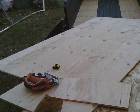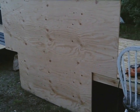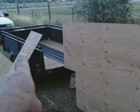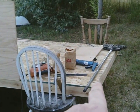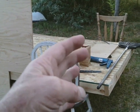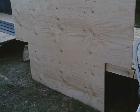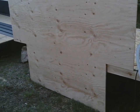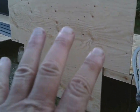Here's the bottom half of one end wall cut out, showing the openings that go over the trailer on both sides. The bottom attaches to the floor framing, with interior framing holding it and lengthwise framing along the side walls. The door is not being cut yet — it's much easier to put the panel up first, since cutting the door leaves only a small strip of plywood to work with.